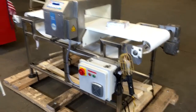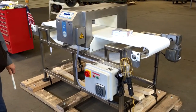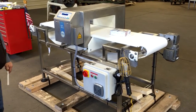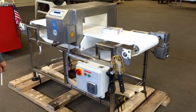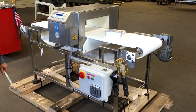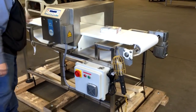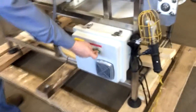Something that's not in the manual: you do have to hit the red button when the machine rejects and the buzzer buzzes — hit the red button to reset the machine. There are several different options for reject devices you can put on the machine. The belt stop alarm reject obviously stops the belt and sets off the buzzer, and you reset it by pushing that button.